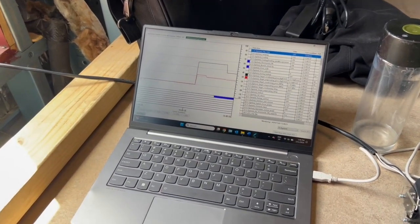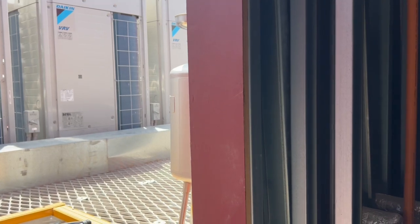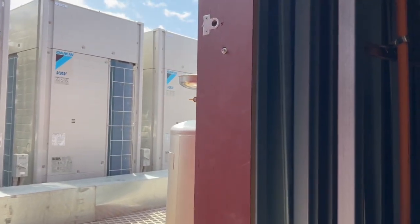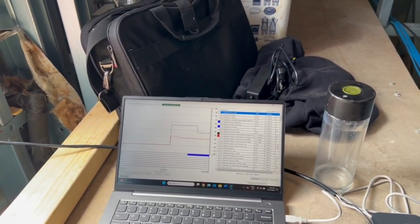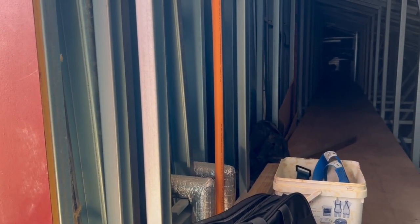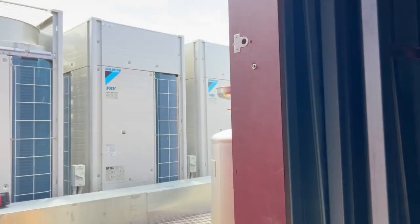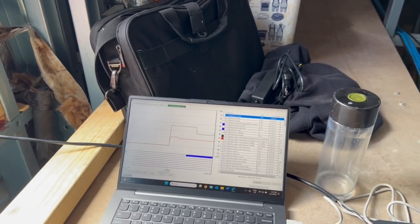Well, that should be the end of this one. We didn't end up replacing the board - that was fine. It just happened to be that for whatever reason someone had switched the isolator off the indoor units, and that was causing the comms issue. That's been running for about two hours now, which is great. Took me a while to find those standalone systems - originally what I was looking for was a multi-head, because how often do you come across a system that has the exact same fault on two different indoors? That's pretty crazy, and that's why it took me a while to find them. I'll have to replace the fan motor and fan blade on that one. The second one is fine - it was just a shattered blade, not sure why it shattered, but no vibrations and the fan spun freely, so I'm going to leave that one as is and just come back to replace the fan motor and blade on the other. This one's now up and running fine. I'm just going to do a quick sweep of the other units to make sure there's no glaring issues, but outside of that I think that's this one done - thank you very much for watching.